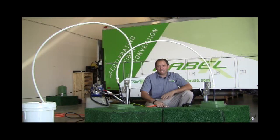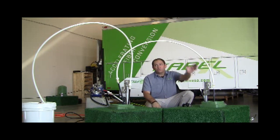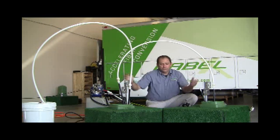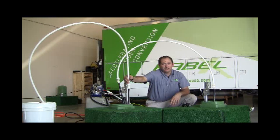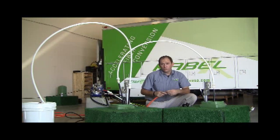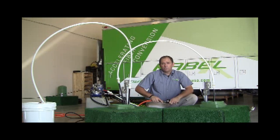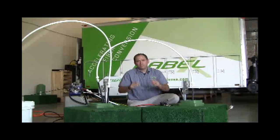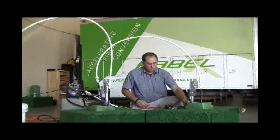The last phase of the CableX process is to clean out the sheath and blow in fiber. What we've done here is connected our ped-to-ped with our union and set up a collection bucket so that we don't waste or lose any fluid. We place a big emphasis on being clean. I'm going to be using pressurized air, so again, the glasses. What I'm using here is a hydraulic line cleaner — industry standard, very easy to find.